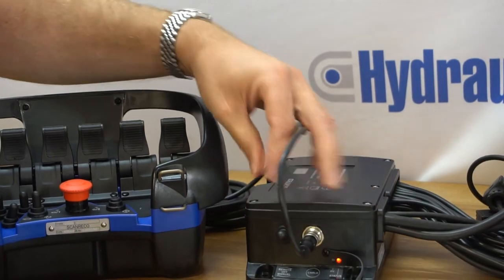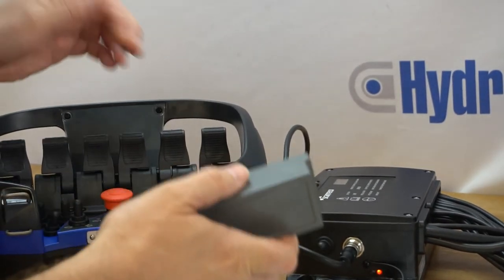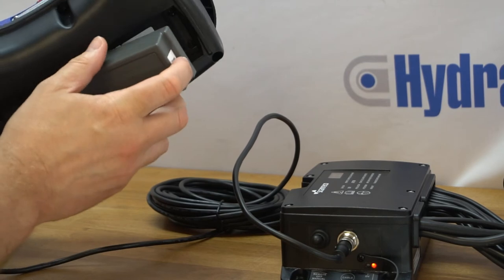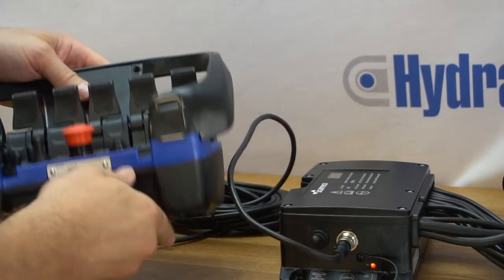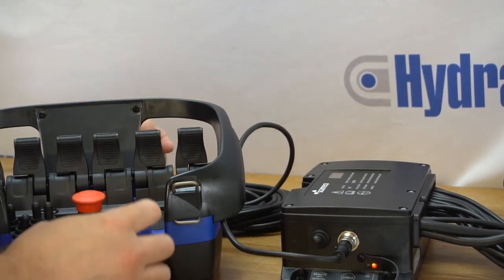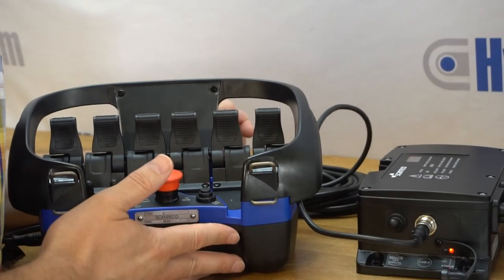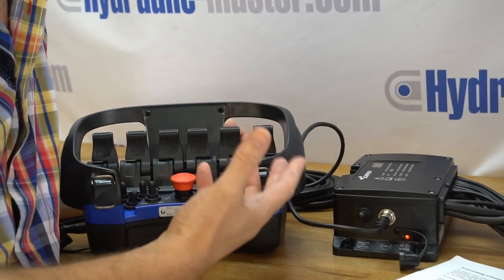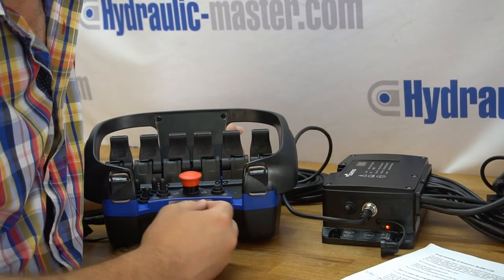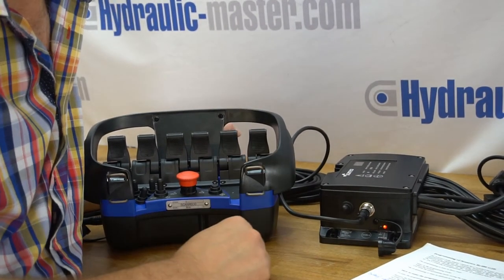Now this is something I believe has been skipped and it's important to mention: you need to then put the battery back into this unit. That is not mentioned in these instructions. The reason we know it's important is because in a moment we're going to be looking for an LED light on here, and that's never going to happen if there's no battery. I've installed the battery at this stage — I believe that's the best stage to do it. If you have any comments on that, feel free to let us know.